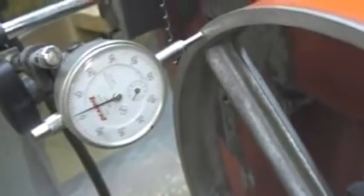I've got the dial indicator set up here. It's zeroed, or pretty darn close to it. Go around and you'll see it go all the way past 30 there — that's the lowest point — and all the way back up to right there. So I'm looking at 15 one way and 30 the other way. That was the stop point there. So that one's out of alignment for sure, sideways. That might be causing my blade to pulsate in and out, I guess.